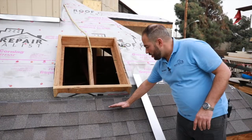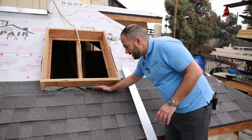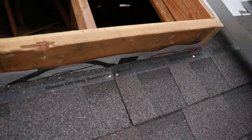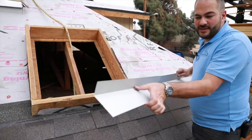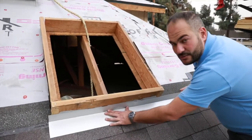We've already got our shingles installed all the way up to this wall. We install our shingles all the way up, and whether it's perfectly flush or we've got 2 inches that needs to be covered, our metal here will cover this up. We call this a 110 metal — it's been prefabricated to 110 degrees from the factory. This side is 4 inches and steps up 2 inches.